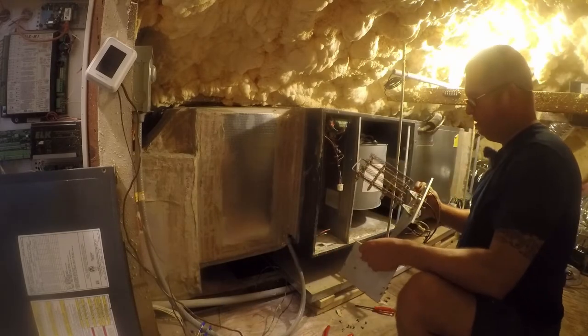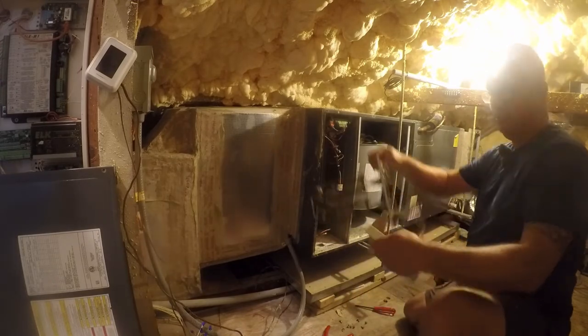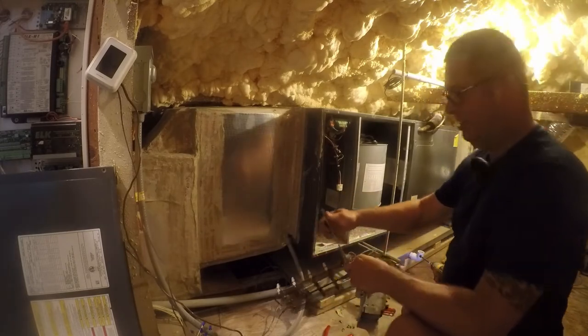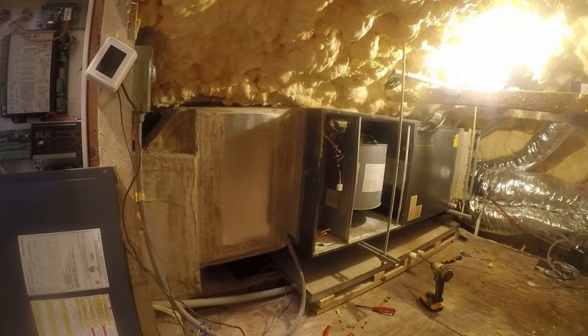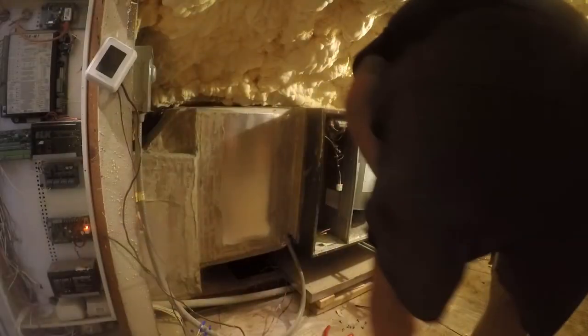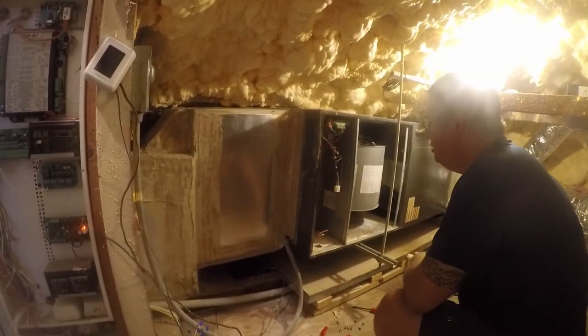So there's our 5kW heat strip. Looks to be in pretty good shape. A lot of dust on that breaker. There should not be that much dust. That means there was an air leak somewhere in this neighborhood pulling unfiltered air in. All right, let me get this out of the way. All right, so